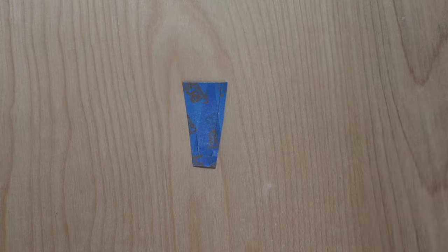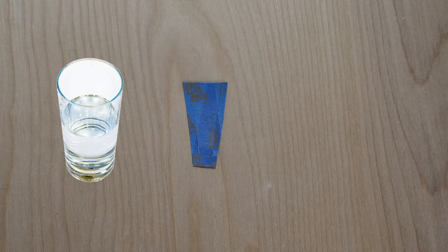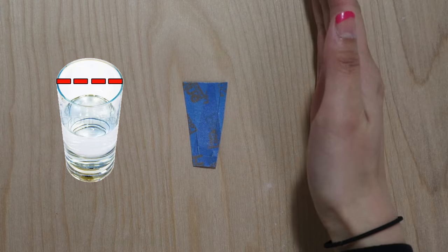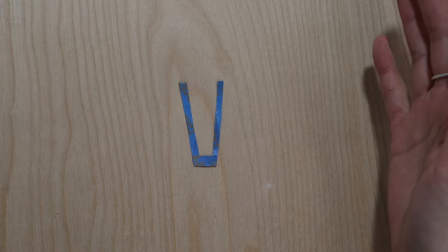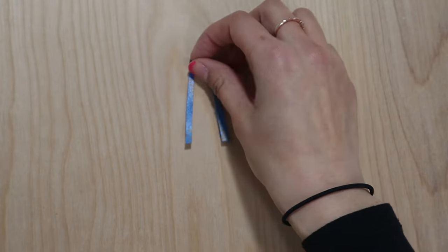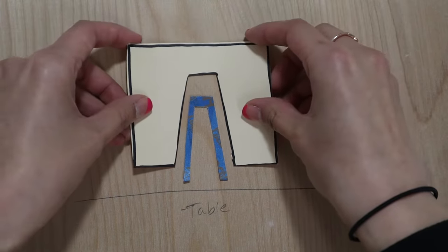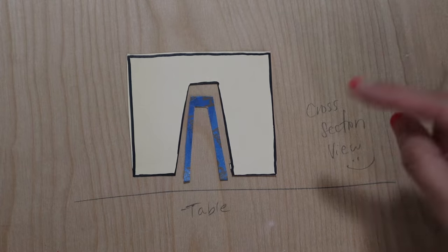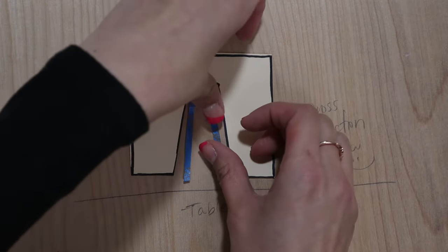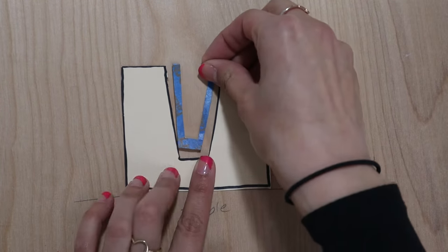I'll show you how it's done using diagrams. Welcome to the 2D world — this is your standard cup. Imagine we were to cut that cup in half, starting from the top down to the bottom. The way we are going to make this one-part mold is that we're going to flip our model — in this case the cup — upside down, and pour our plaster on top. Remember, this is a cross-sectional view. After the plaster has hardened, we take the mold right side up and the cup comes easily freed.